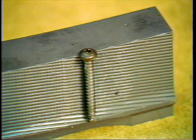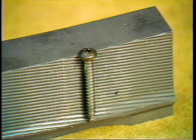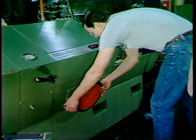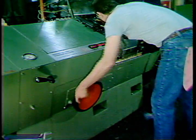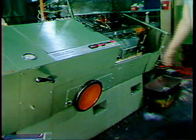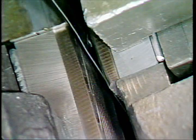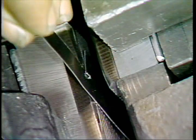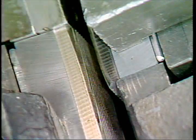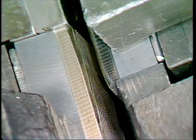As you fine adjust die squeeze on gimlet point dies, you must check the cut off clearance. The cut off edges cut off the excess blank material as the gimlet points are formed. To check the cut off clearance, hand crank the ram until the cut off edges are opposite each other, watching to be sure they do not hit each other. Slide a piece of six thousandths shim stock between the cut off edges. There must never be less than six thousandths of an inch clearance, as this could allow the cut off edges to strike each other and damage the dies.